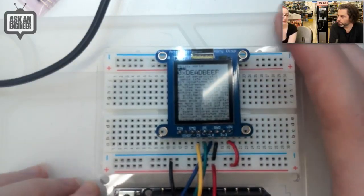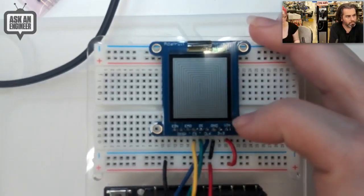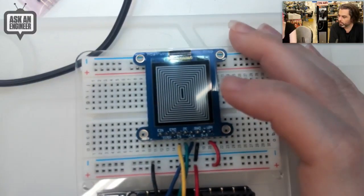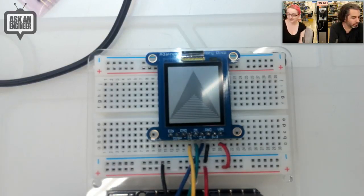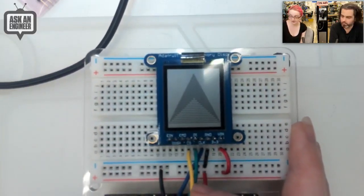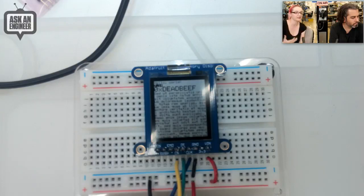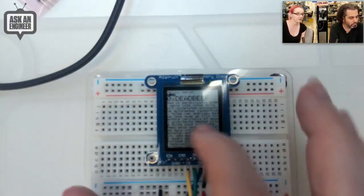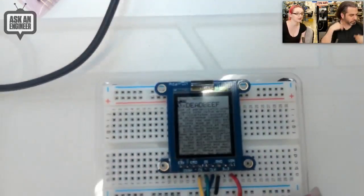Like e-ink, it's low power. See what happens — I'm going to reset it. I unplug the board, the display stays for about three seconds. You only need to pulse a pin for a microsecond or millisecond to refresh it. So for very low power stuff, this is great. It's like the snapshot of displays — you look at it and it disappears slowly. But it's high resolution and extremely visible in daylight. These are often used for smartwatches and outdoor displays because it doesn't need a backlight like a TFT — it looks like paper basically. And it's got this high-res screen; you can see the text is quite small but legible. We have a level shifter and regulator on there, so you can use it with a 3V or 5V microcontroller. Used here with a Metro Express and it works lovely.